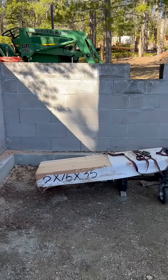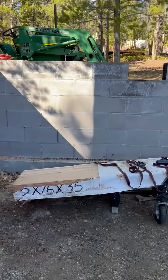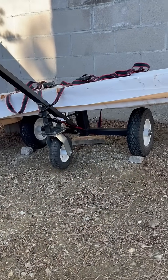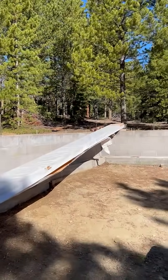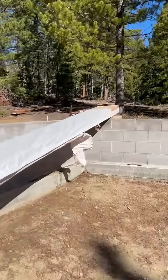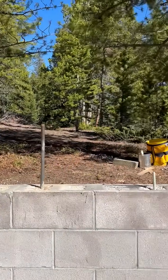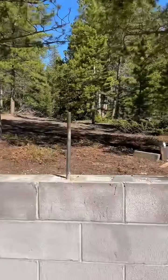Here's the next step in moving the beam into place. I've got a trailer dolly that I've ratcheted and strapped to the bottom of the glulam. You can see we're still leaning on the wall. I'll take the tractor, lift the far end maybe 18 inches at a time. The problem is I've got to get over these wind anchors and get it all the way down to the seat. So we'll just do it in baby steps.